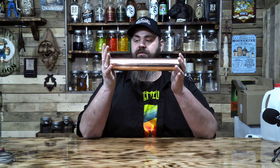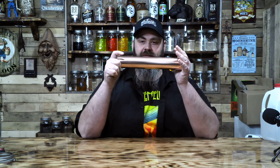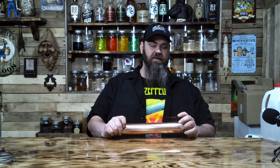Hey y'all, today I'm going to show you how to solder stainless to copper — it's one of the hardest things for most people to figure out. When I was figuring this out, I got solder and I bought flux and I tried like crazy to get solder to stick to stainless. It won't stick, just rolls off. I bought all kinds of solders, all kinds of stainless, and then Shawn Rigsby said it's the type of flux you're using.